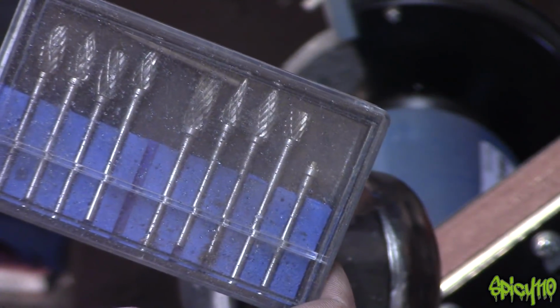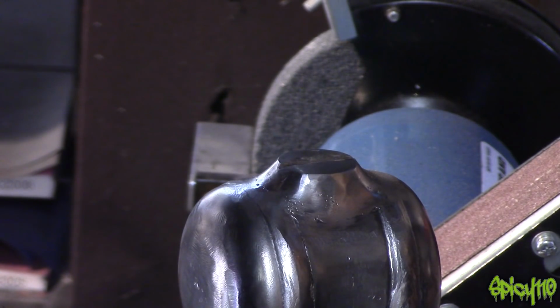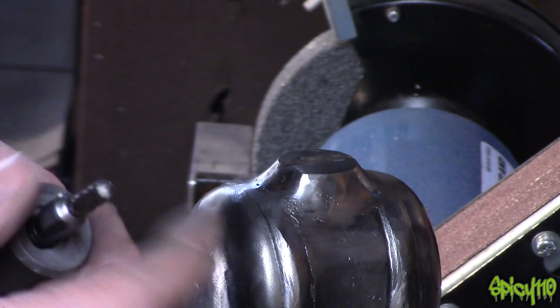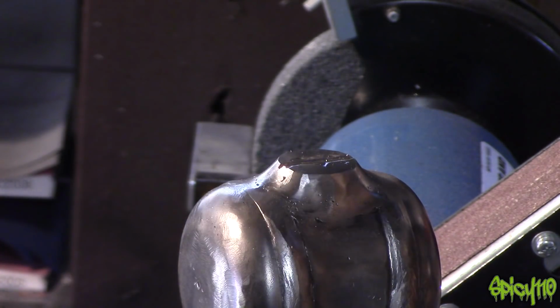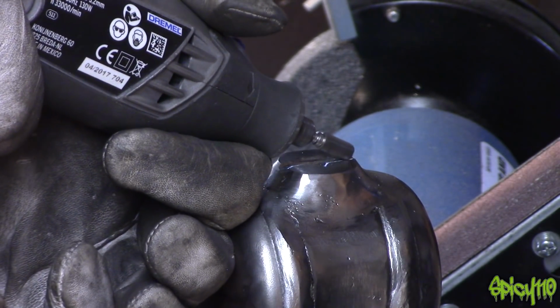So at my die grinder set, I want to choose something that's barreled, as in straight, but also with rounded ends. These things are absolutely fantastic. They were super cheap. You stick them in a Dremel and they'll eat their way through hardened steel, everything I've tried. Gloves, gloves, gloves. I've had enough of picking bits of steel out of my hands.